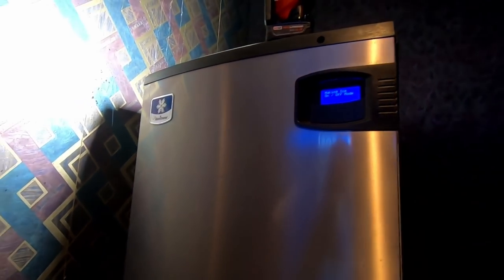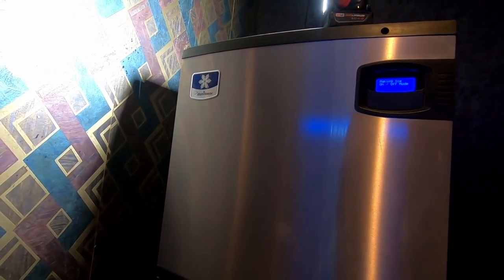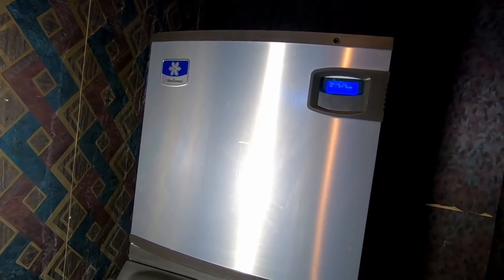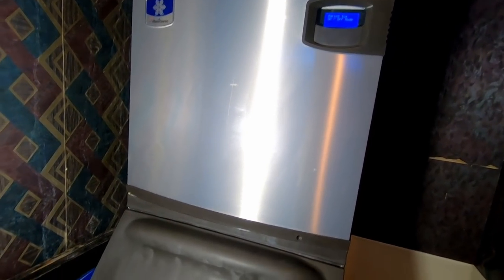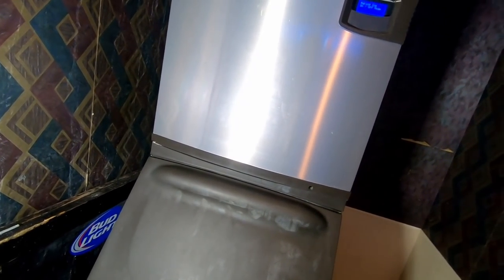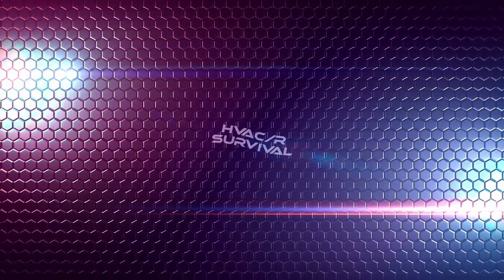Hope you enjoyed it. As you know, most of the problems with these ice machines are water related. It usually comes down to proper cleaning and sanitizing — after that there are just multiple different issues. As long as you keep your machine clean, you've got 20 pounds of water pressure coming in, and it's clean water, it should work. If not, you probably have a refrigeration issue. That's going to wrap this one up — if you liked it give it a thumbs up, don't forget to subscribe, and check out our Facebook and Instagram. Until next time, catch you on the next one.